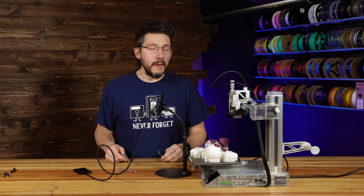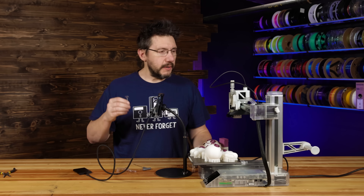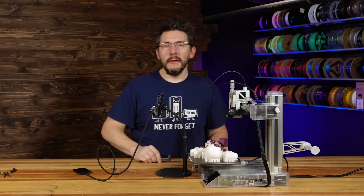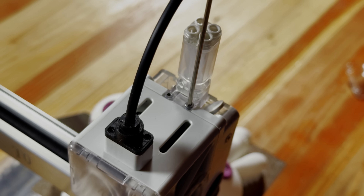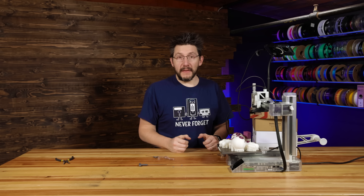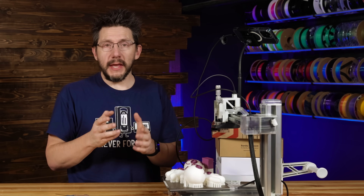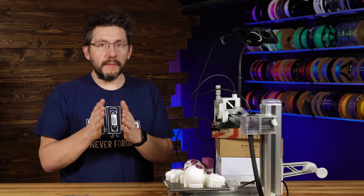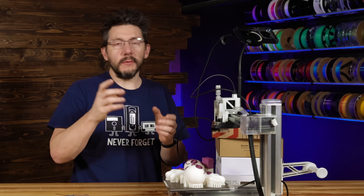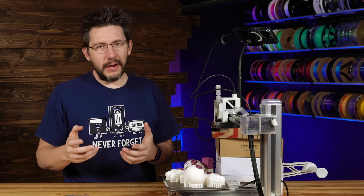The next step is to get the tools that came with your A1 Mini — in this case, the little hex drivers. We're actually going to use the big one and take two screws out of the top. These are pretty easy to remove but they're tiny, so don't lose them. The next step requires a little finesse: what's connected to the piece we're taking out is a ribbon cable that goes to the filament detection sensor, and it's kind of coiled up on the inside, so we need to slowly take it out without ripping or tearing it.